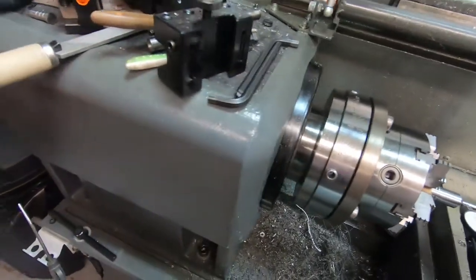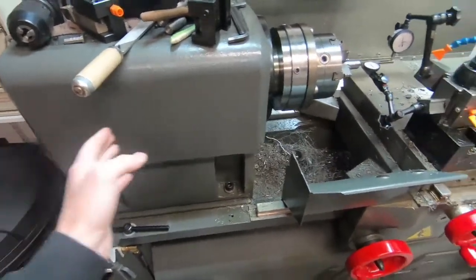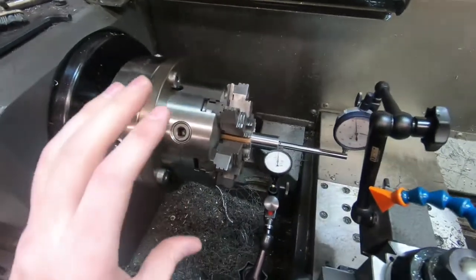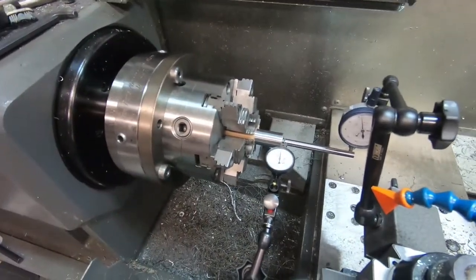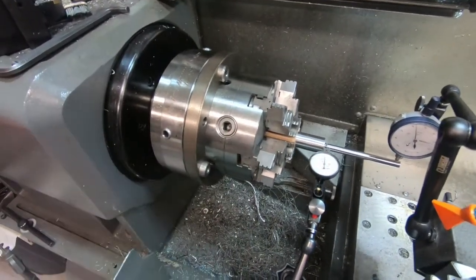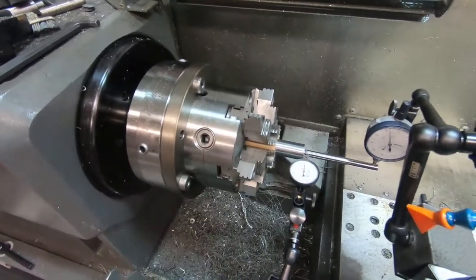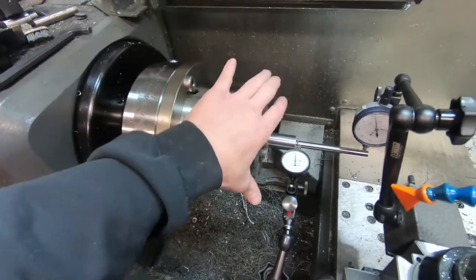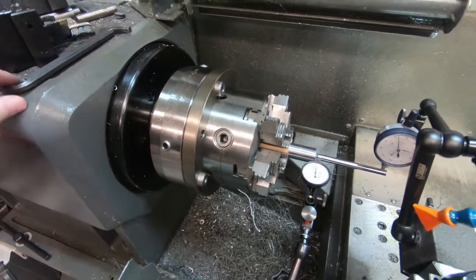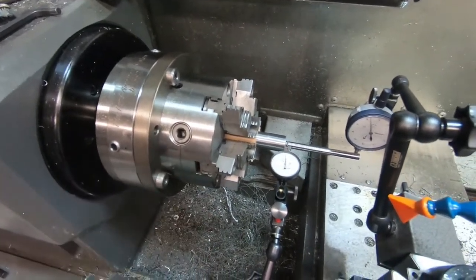This system is ideal when you don't need a lot of the outboard spider that would normally go on the outside - especially with a CNC lathe where the headstock is too long for that kind of setup. We've got a six-jaw chuck that clears evenly on the barrel, and we're able to do all the adjustments that a spider or outboard indicator would allow on a typical lathe setup, but without the stress points of dialing in the chuck, since this is a separate clamping system. These just take a five-sixteenths Allen wrench, so we'll go around and get it indicated, then come back and show the final readings.